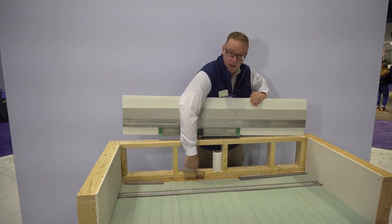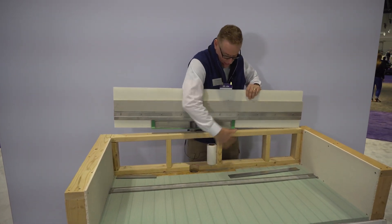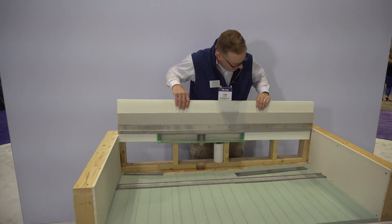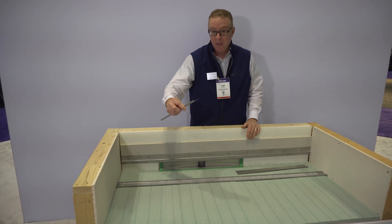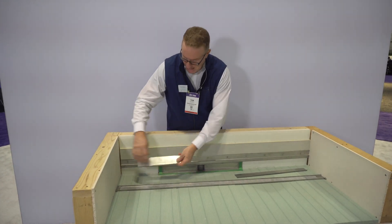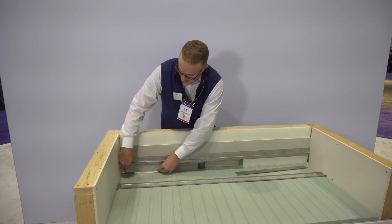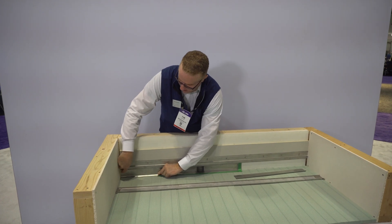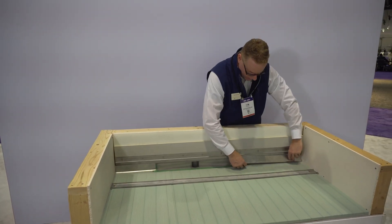You're going to drill a three-and-a-half inch hole — it's going to be half in the wall plate. It doesn't matter that it's off-center. Once it's installed, it comes with these trough extensions that can be trimmed down to size. When you install them, it's done with thinset. You put more thinset around the back end here and it angles the trough extension towards the drain.